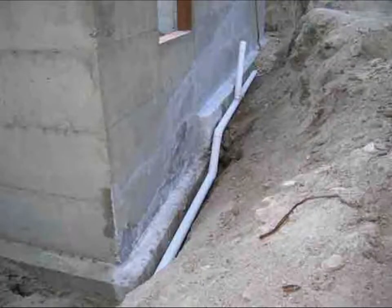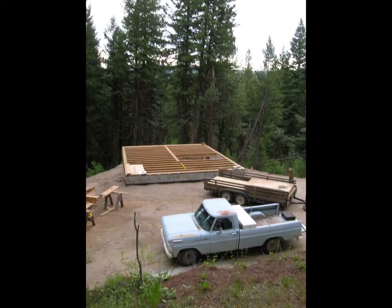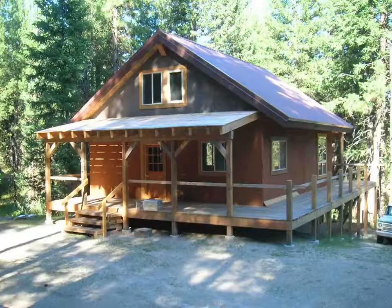The upper and lower drain pipes were connected with 45-degree T's. My primary goal in the backfill and grade work was to slope the earth away from the building. Even the parking area on the uphill side slopes down towards the truck in this picture. The cabin's long eaves and porch roofs also help shed water away from the building. I suspect that the landscaping and the roofs do the most to divert water.